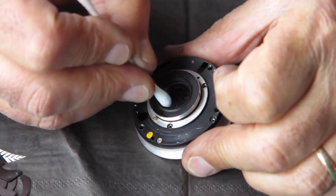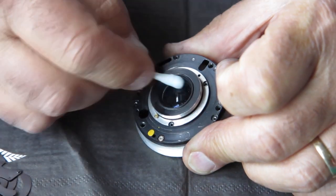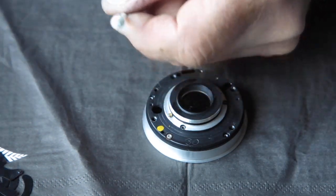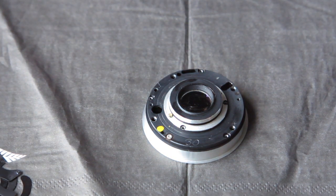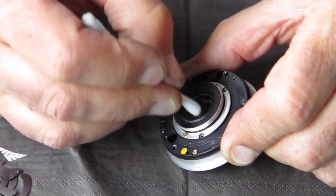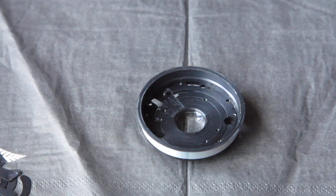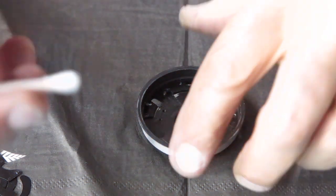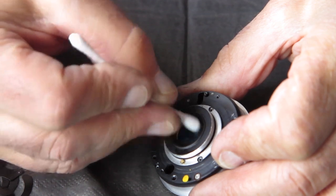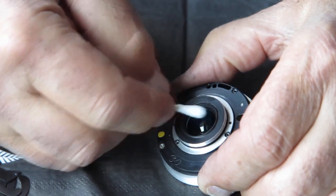And here I'm just using normal domestic glass cleaner, window cleaner. You can see the amount of filth that's coming off there. That's pretty dirty. Particularly with the first pass, be very gentle, don't apply a lot of pressure to that glass. You don't want to grind in any particles of grit. Mostly interested in lifting off any particles of grit or dust or anything else that's on there.